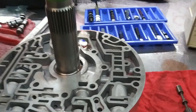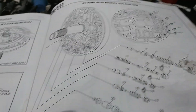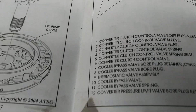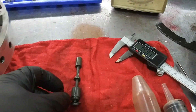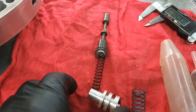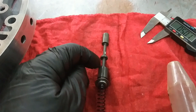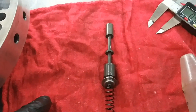The torque converter clutch valve is located right here - I'll show you a picture of that in the book. We found a problem with this spring. Somebody had been in this thing before and changed the spring for this valve, which is called the converter clutch valve spring, number four. This is what we found when we took it out. We found this spring which does not fit on the seat of the booster and also does not fit on the seat of the valve itself very good. When we took that out, we realized it didn't work right. Not to mention, we noticed this valve would travel very little, if at all - it wouldn't open or shut any of the gates, traveling maybe a sixteenth or an eighth of an inch.